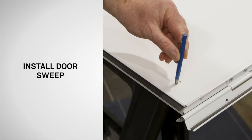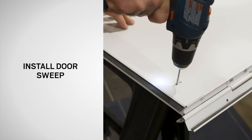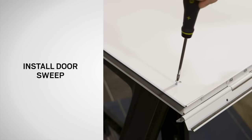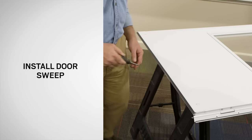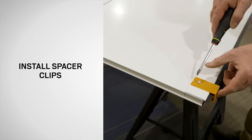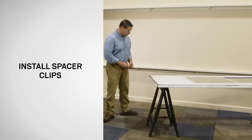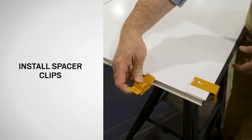This will allow for vertical adjustment of the sweep later in the installation. Using the 1/8 inch bit, drill holes 1½ inch deep at the marked locations, being careful not to drill through the panel. Then use a Phillips screwdriver to secure the sweep with the painted 1½ inch screws from the pink bag. Do not fully tighten the latch side screw. Install the sill spacer clip under the latch side sweep screw and tight against the bottom of the sweep. Tighten the sweep screw to keep the sill spacer clip in place. Install the latch side spacer clip over the latch side of the door panel about 6 inches from the bottom of the door panel.